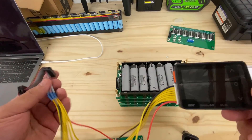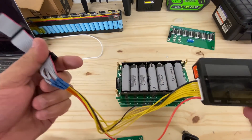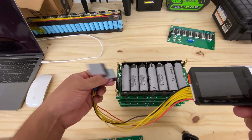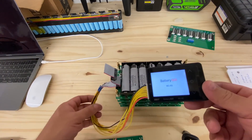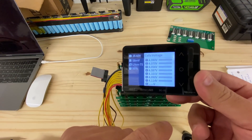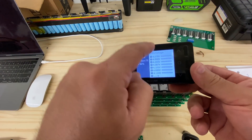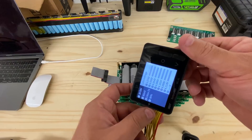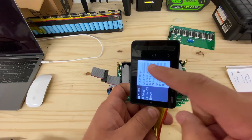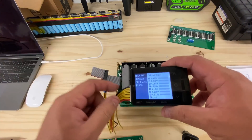This is great. If you don't have one, look for the ISDT BG-8S. You'll have to make a little cable — you can get these on Amazon and solder it into the ribbon cable. What it does is when you plug it in, it shows you each individual cell level one through seven. Here they're not a hundred percent equal, but they're pretty balanced — it's good enough.